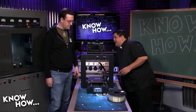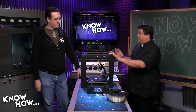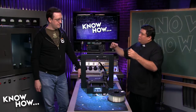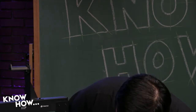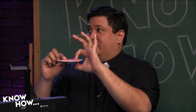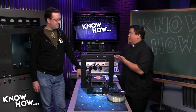Now we're going to go ahead and do the leveling routine, and this is not as simple as it sounds because you actually need to do this routine multiple times. A mistake a lot of people make is they run it once, do all the leveling, follow the instructions, and think that's good. The problem is on a bed like this, as you move the screws to level one corner, it's by necessity going to unlevel another corner. So we go to Tools, then Level. I've got a leveling card — I got this from my Dremel, but anything about 0.3 millimeters is just about perfect. We want just enough clearance for the head to touch the card but not really hold it.